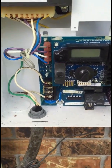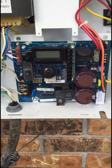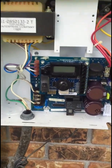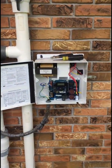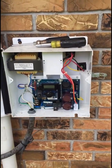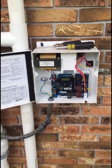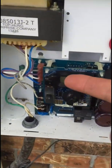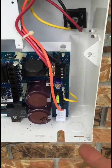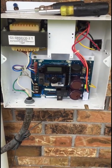The new board is in and all the wires are connected. They come default set up for a T15 cell, which is what I have, so I don't have to do any additional programming. Again, if you do have a different cell — like a T9 — you would have to program this first before plugging in your salt cell. It's easy to do, just something to note.